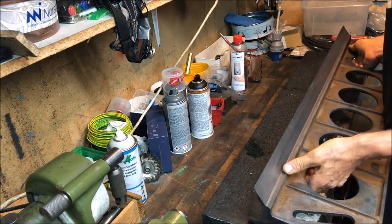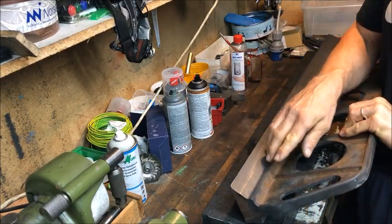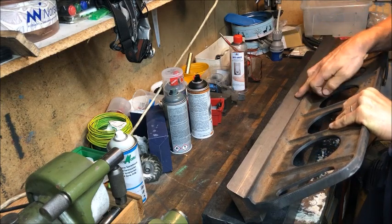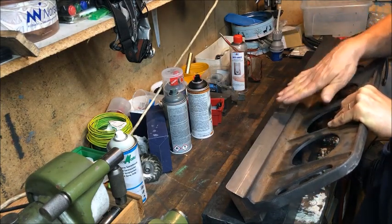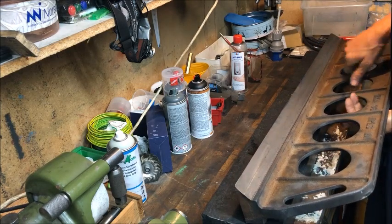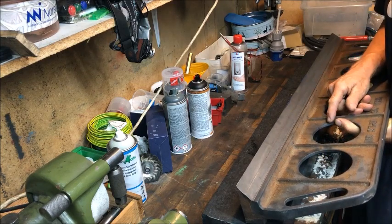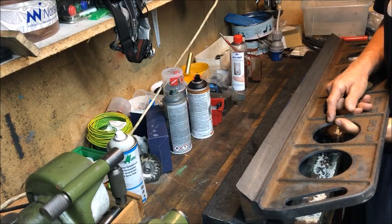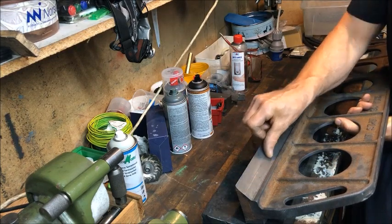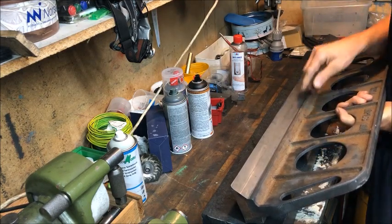As I said, we only took two sides, so I have to move around the other. This side was actually some four millimeters down in comparison with the rough scale, so we had to take it around five millimeters down. And you can see a stripe here also, which was the remains — a little bit of problems with the down feed. The automatic feed stopped and then it just polished a thin line there.